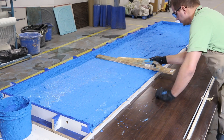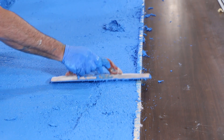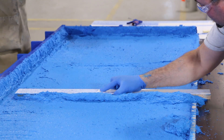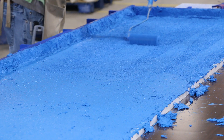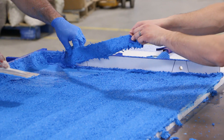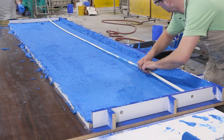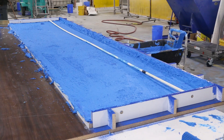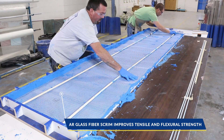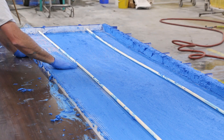A wooden derby and float are used to ensure the backer is evenly placed. Finally, we screed the back to ensure a uniform thickness. We are now ready for the conduit that will hold the threaded rod. We removed the tape on the sides, giving us a clean edge to work with. A length of continuous scrim was placed on the back side. Using scrim on a counter like this is always a good idea. The backer mix was allowed to stiffen up, making it ideal for encapsulating the conduit as well as building up the drop edge.